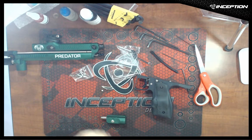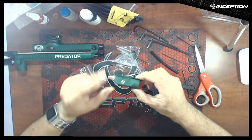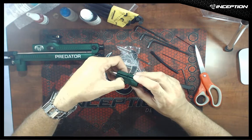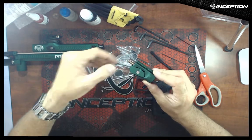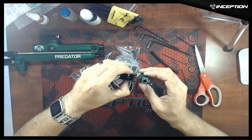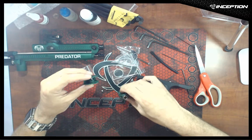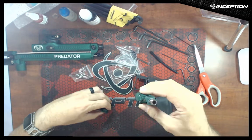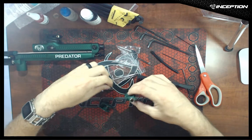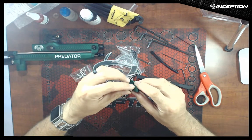The ASA is actually mounted with hidden set screws, so we have to take the cam piece off in order to do that. We're going to push the button, bring the cam down to its lowest point, then push the button all the way across and keep opening it up. That will open up the cam system and you'll end up with the main body which has the pivot pin — make sure it doesn't slide out and fall on the ground — and the cam which has the button and the spring for the button tension.